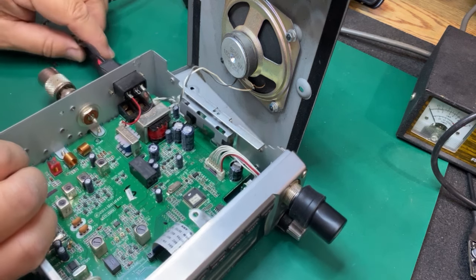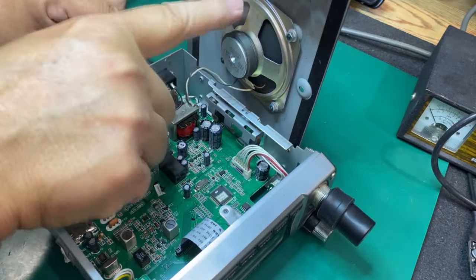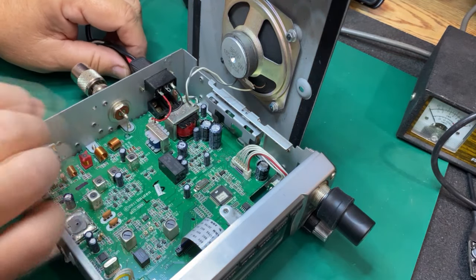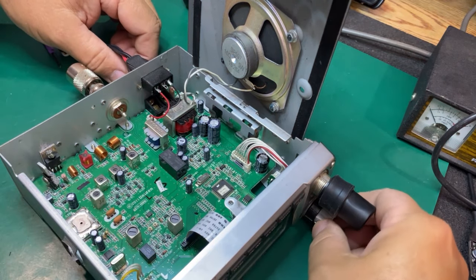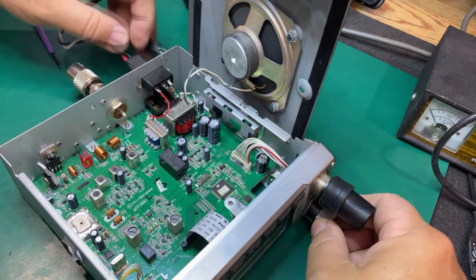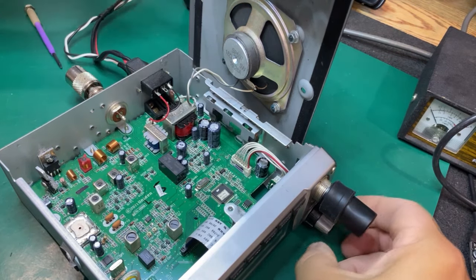I've got this little jig made up here — this goes to my external speaker. I could take a little 1.5 volt battery and pop that speaker by desoldering the speaker lead and sticking that battery across there. It's pretty rare that you lose a speaker. But I just saw something that alerted me to a possible problem — this is pretty common. This radio has been through a lot and has a lot of grime down in here.